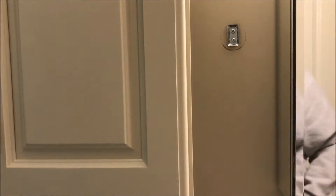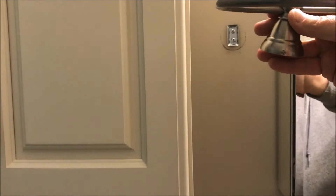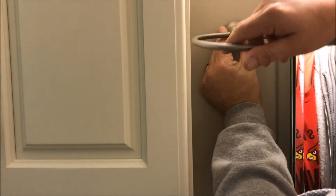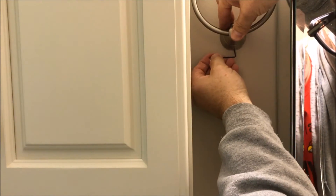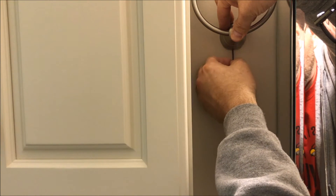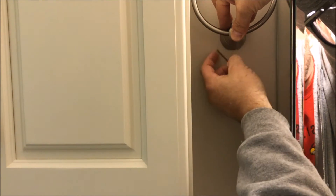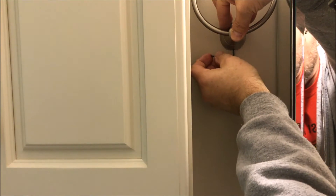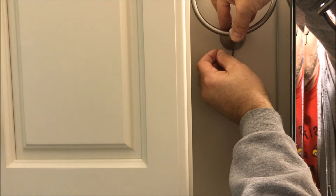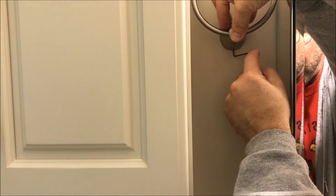The holes are a little larger than they need to be, but that looks pretty good. Now you can see that on the bottom of this towel holder there's a little set screw that uses an allen wrench to tighten it. Put it on here and make sure the top and bottom are over the set screw — and they are. Now we're going to tighten it down. It's hard to do right up against the wall, so you just have to take your time and snug it up.